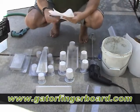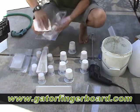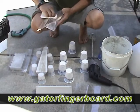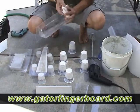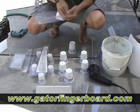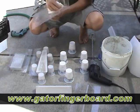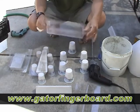To get that film off, get some denatured alcohol. Take a paper towel, put the denatured alcohol on it, and just rub it until it all comes off. Get it as clean as you can — the cleaner you have it, the better looking the cement piece will be. This is actually really easy and it's light, so it'll be easy to ship compared to pre-made cement pieces.